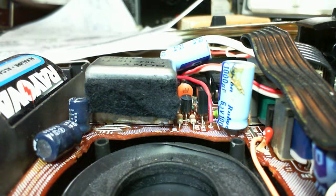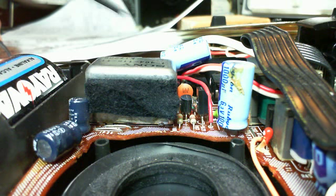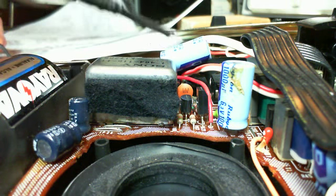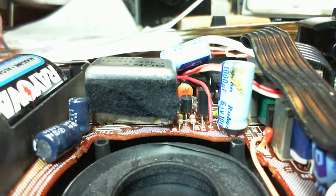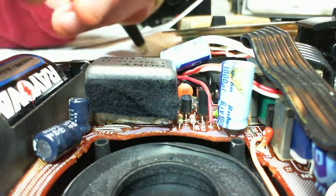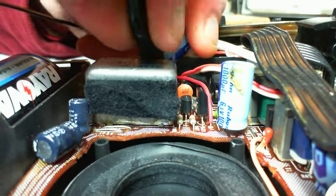Now these voltages must be referenced to ground, and let's see, I might be able to pick ground off these bigger capacitors. Like this one's got a real exposed point on it. 1000. There's two 1000s right in here. This has got to be them right here. There's 1000. So I'll bet you that's an excellent ground point, which you can't quite see. And I'm going to clip onto it, because it's actually big enough to get a clip in there. I think it's big enough.